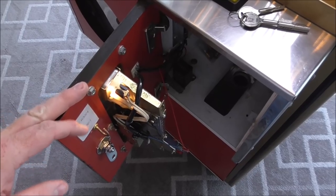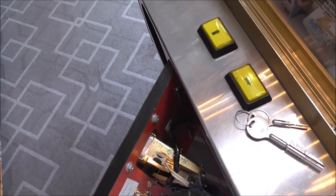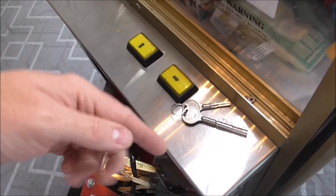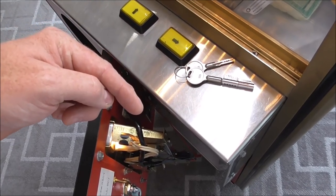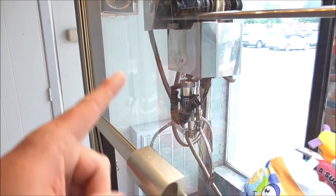Well, I tested the diode, and it actually was fine. I hate replacing diodes that test fine. Sometimes they are bad, even if they test good. So what I did was I took the connector off the back of the board and followed the green wire. Well, I checked it with continuity first. And so from where it came onto the board to the diode, all the way up to the switch, it was not connected. So it was broken somewhere in between.